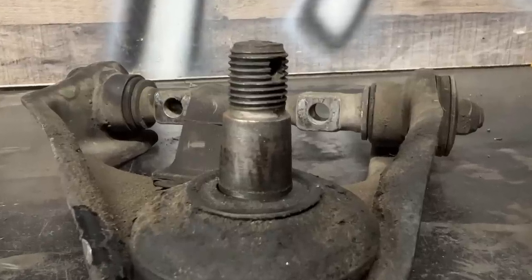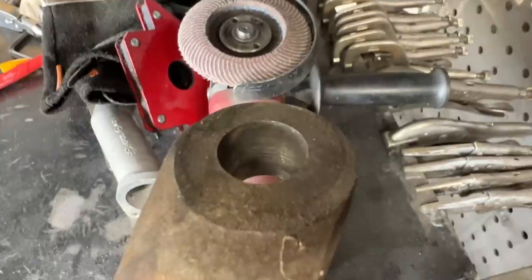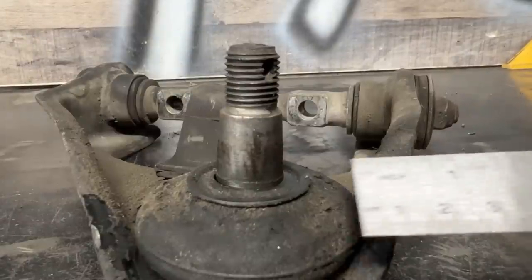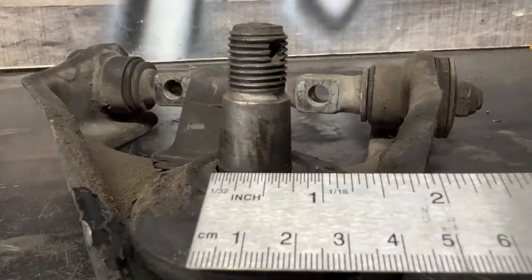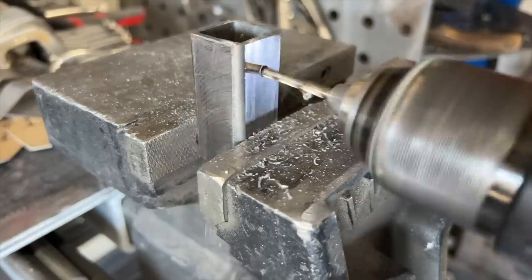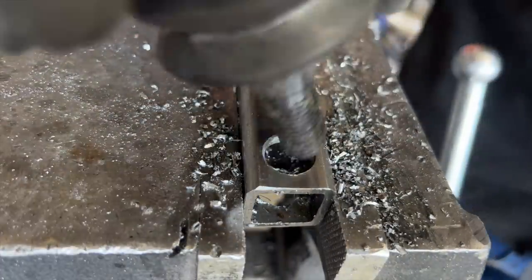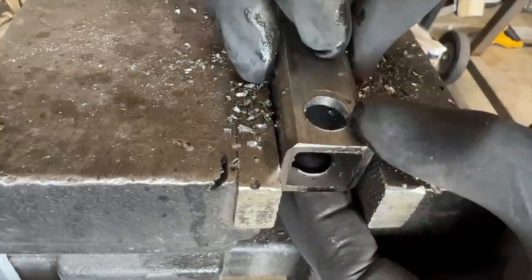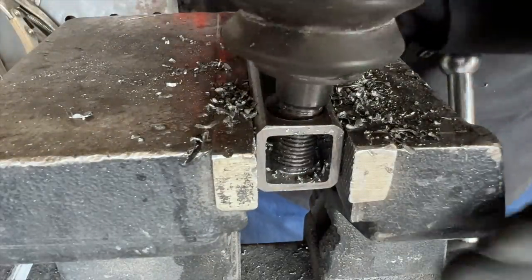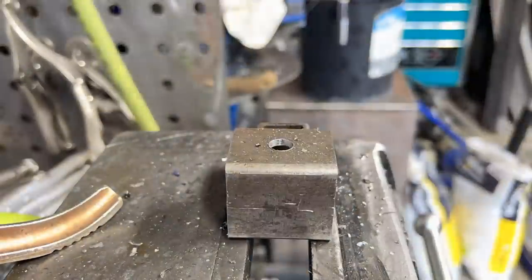I need to create something to secure the ball joint's tapered stud. When the ball joint is installed on the vehicle, it sits in a solid chunk of steel with a tapered hole — but do you have a tapered drill bit? I don't, and luckily I don't think it's required. Measure the widest part of the taper and find some square tubing a little larger than that. My ball joint measures three-quarter inch at the widest point, so one-inch square will do fine. Drill a pilot hole all the way through the square tube, and on one side open that hole just big enough for the threads to slide in — a step bit works great for this. On the other side, open the hole until the taper drops in and the threads pop out on the other side; don't drill it too big or it won't be snug. Weld this piece to your sliding sleeve, install a set screw, and you're done.